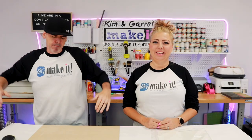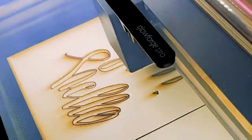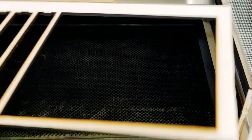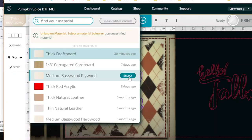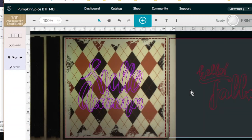Step five: now we make our accents. We're going to take the quarter inch MDF back over to the Glowforge one more time and cut out our words and accents that we exported as an SVG. Then we're going to take our DTF backers, put them back in the Glowforge, and add score marks so we know where these words and accents go on our backers. We're going to use the board that we cut it out of earlier, place the board in there so we know it's straight, and use the cardboard score settings — just score it lightly. This way we'll have perfect letter placement when we go ahead and put the letters down.